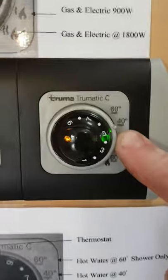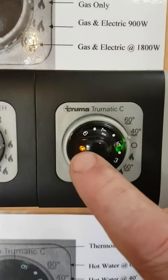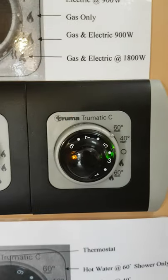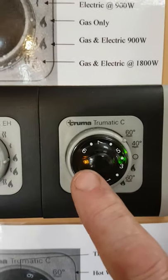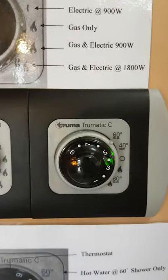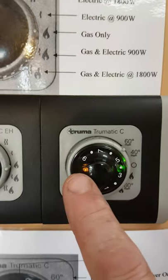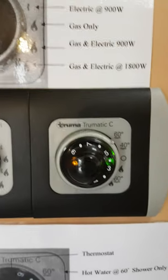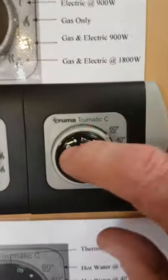The right way to have a shower is to put it to 40 degrees and let the yellow light go out, then about 10 minutes before your shower put it up to 60 degrees. The yellow light will come on — don't even wait for it to go out. After five to ten minutes go to the shower and the boiler will still be running as you're in the shower, giving you the maximum amount of hot water.